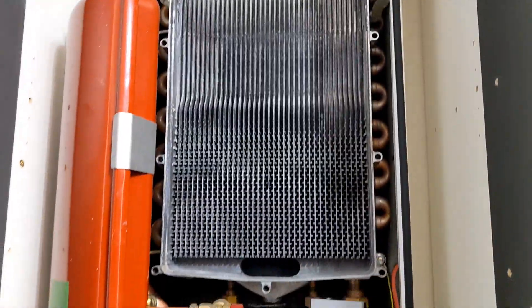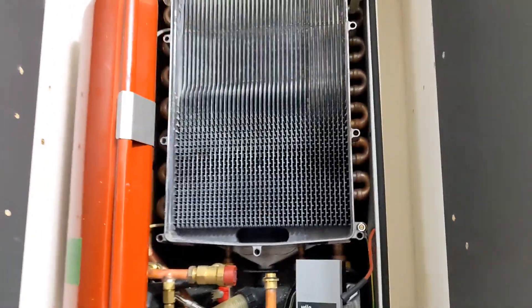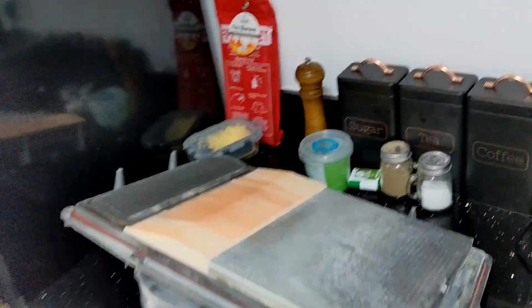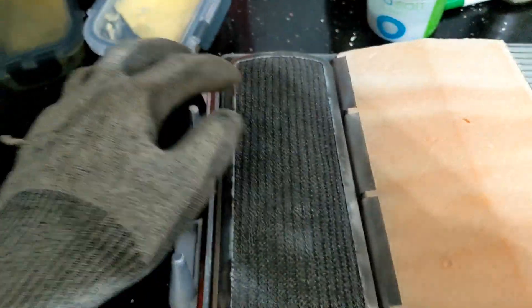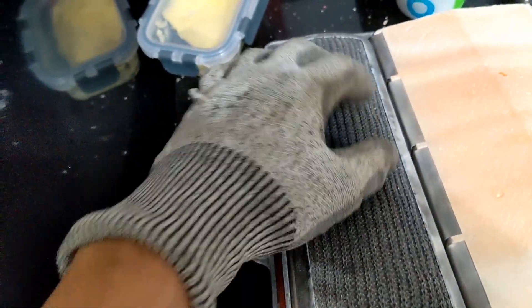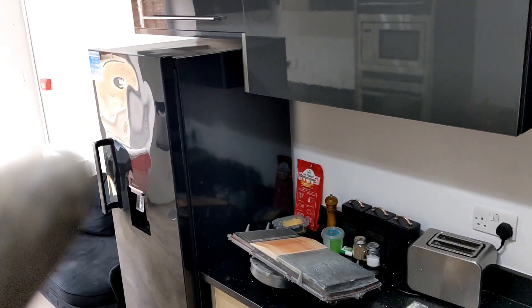So that's the burner out and that's the main heat exchanger there. This particular model doesn't actually have a plate heat exchanger — it does the heating and hot water all through the main heat exchanger. Taking it out here, and it's been giving explosive ignition and the reason is, see the burner — it's all gone soft and spongy. That's why we've been getting intermittent ignition fault and explosive ignition, not to mention the ignition electrode as well, which looks like it's seen better days. So we're going to change the electrode and the burner — that's what they call it — and give this all a clean through and a wash through as well.